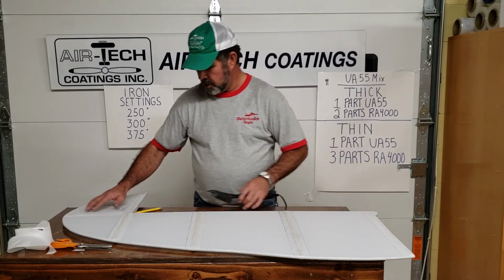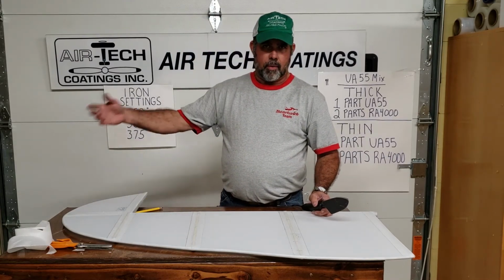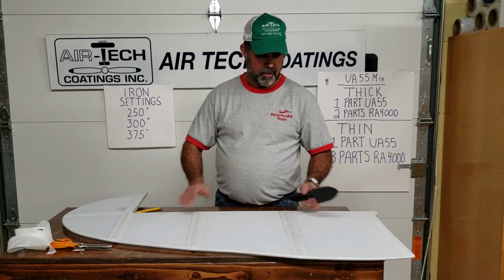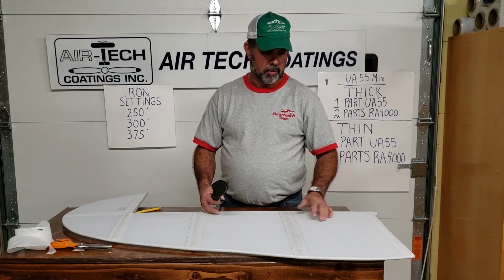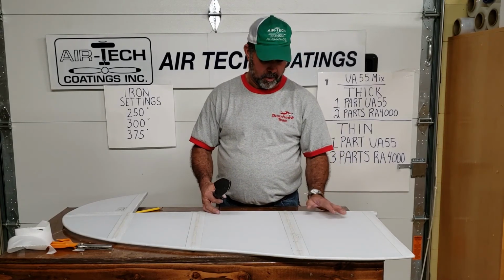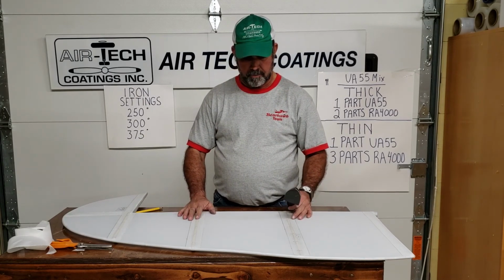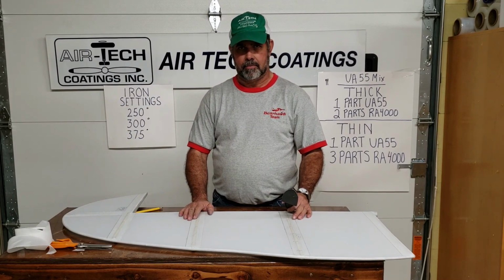So at this point, you would be finishing up and doing all the final ironing, and that's where we would go over into getting ready to do some fabric wash and cleaning it and getting ready to prime. At this point, you'd probably be having your drain grommets put on, or burning your hole in for your drain or whatever. So that concludes the part of just covering and putting the tapes on, and I'll have a separate video explaining a little bit on bias tapes.